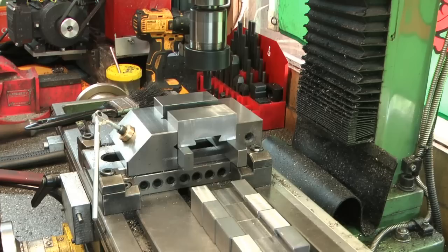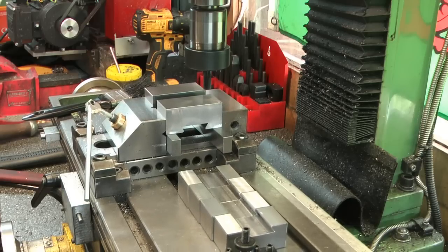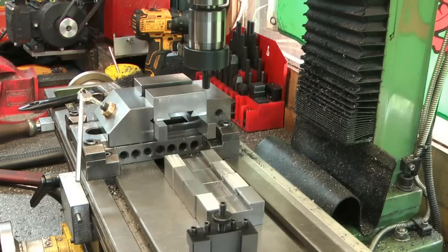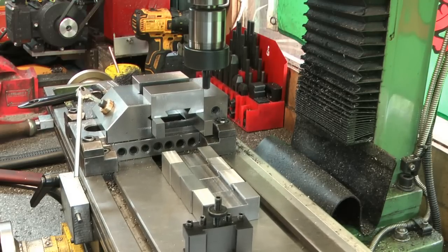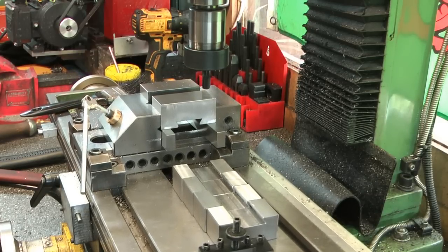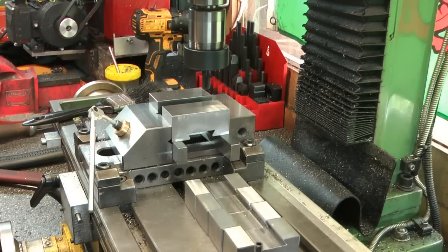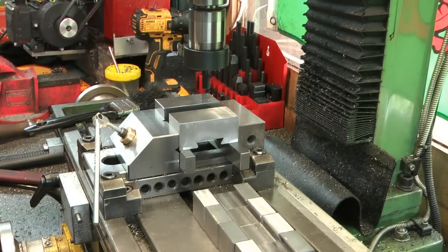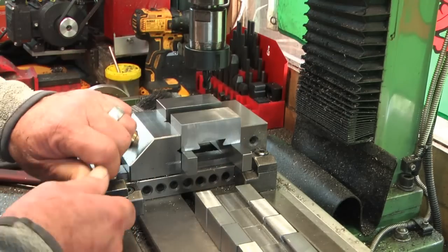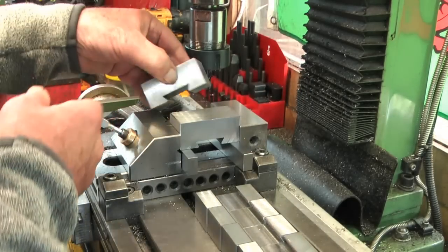I'll do the back face. I've been meaning to make up a little chamfering jig for putting 45 degrees on blocks with a router motor - it would make an interesting little project. I've seen a few people do that with a carbide end mill, a little jig with a 90-degree nest in it so you can just run blocks through. I'm regularly doing machining chamfers on things, but for standard block work like this that might be a good idea. You can see I've got the chamfer on there now.